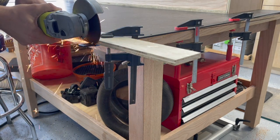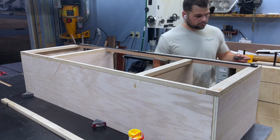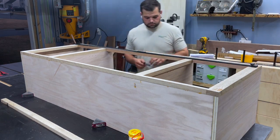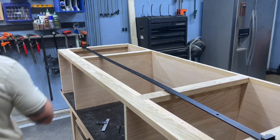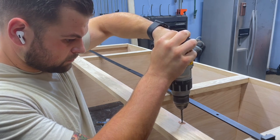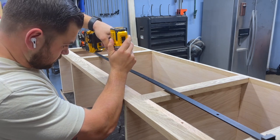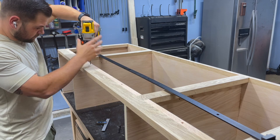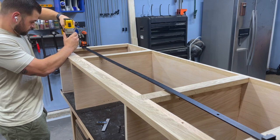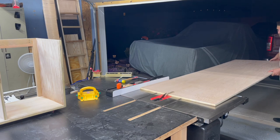We're going to be adding some sliding barn doors to this cabinet. I got a basic hardware kit off Amazon and then used a straight edge and my angle grinder to cut it down to the size I needed. I went ahead and filed the edges and painted everything just to avoid any rust. Once that was done, I laid it out on the cabinet for spacing and marked for all the holes, then came back with a brad point bit and pre-drilled all my holes — left them a little bit undersized from the bolts going through, and I did not go all the way through. I ended up cutting those bolts down off camera so they wouldn't be protruding on the inside and catching any electronics or the owner's hand.